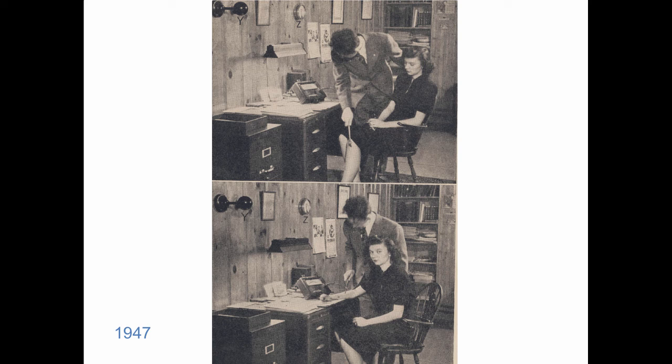We lose 100 BTUs per hour by evaporation. So she's perspiring right now because this guy's got this thing there, on her leg. But she's perspiring a little bit. When you perspire, the water evaporates and it takes heat with it. So she's losing 100 BTUs per hour right now. And if she were to pick up some of that paper on the desk and fan herself, she would lose another 100 BTUs per hour by convection. But fully 200 BTUs per hour, half the BTUs that she has to lose, she's losing by radiation.